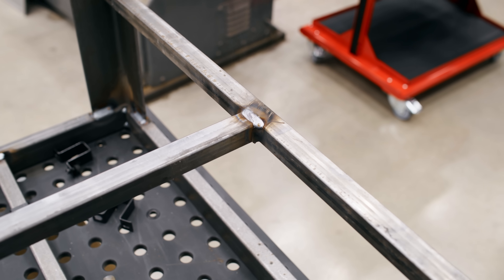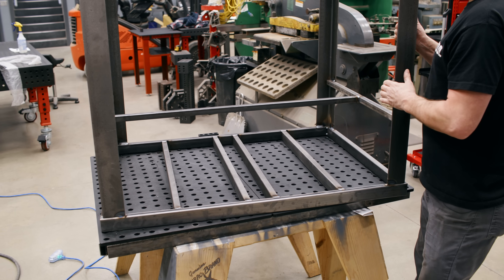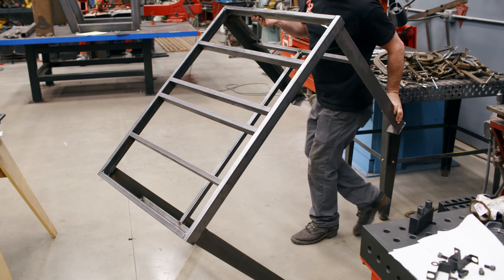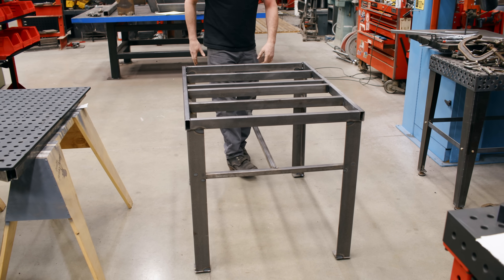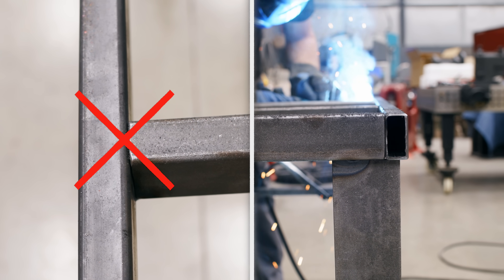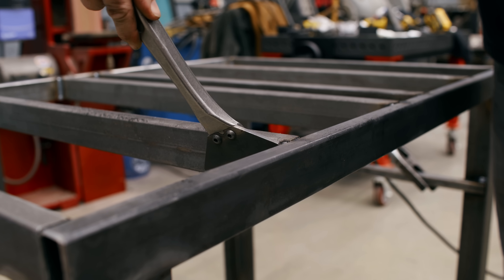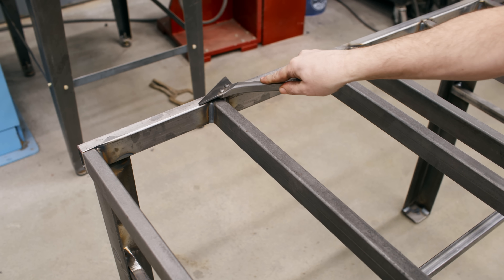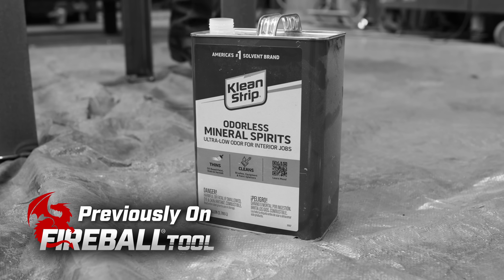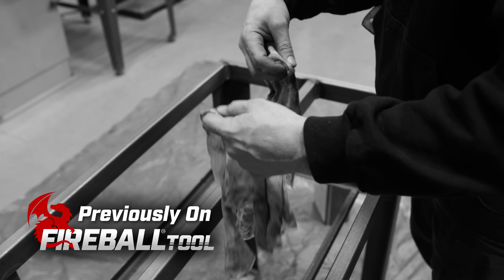It's at this moment that you schedule an appointment with the organic mechanic. We're going to lift this thing off — much more helpful if you have two people, but we're going to do it by ourselves. Now I'm going to weld down the fillets and avoid welding the tops because I don't want to come back and grind them all. We just need to make sure we don't have any spatter or BBs anywhere — get them cleaned off so we're ready for paint. After removing the weld beads, clean the metal surface with mineral spirits, acetone, paint thinner, or brake cleaner to wipe off any dirt or grease.